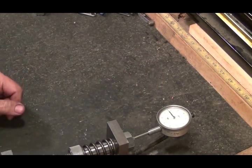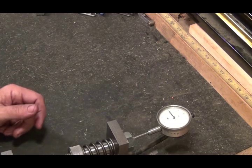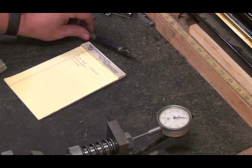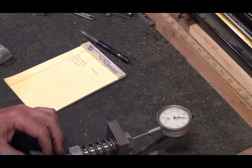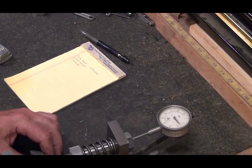The reading came out at sixty-six and a half. I shut it off and got my notepad — the pure lead was 0.0665. Right now I have a piece of wheel weight in here and I'm going to give it one turn.